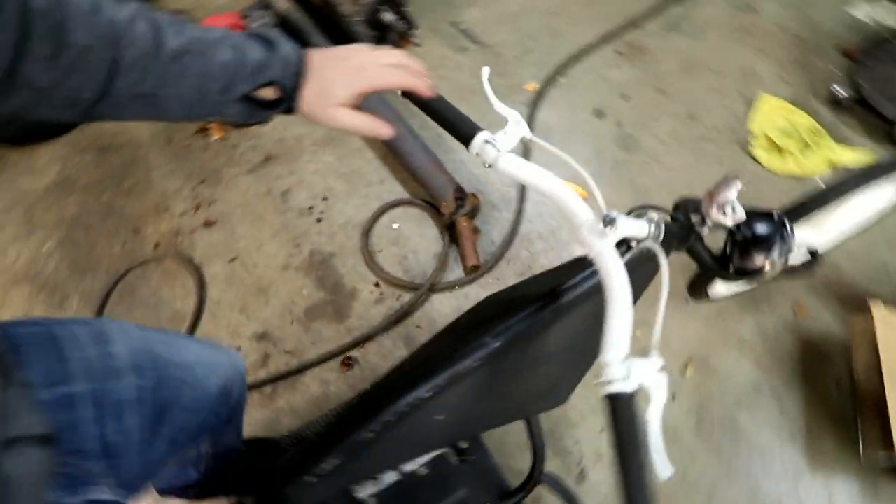One little caveat: be very mindful of how you run your cabling, especially the water-cooler hoses. The Magic Wave has a sensor that monitors coolant pressure, and if the pressure gets too high it'll throw an error code. This is so it can tell you about an issue before your torch overheats and melts. On my setup initially I had everything zip-tied together to make it neat, and those zip ties created enough restriction to trigger that error code. A buddy of mine actually braided his lines together and it caused the same issue. So just be mindful of that — other than that, you're good to go. Thanks for joining me, I'll see you guys more this week. Go do work, son.